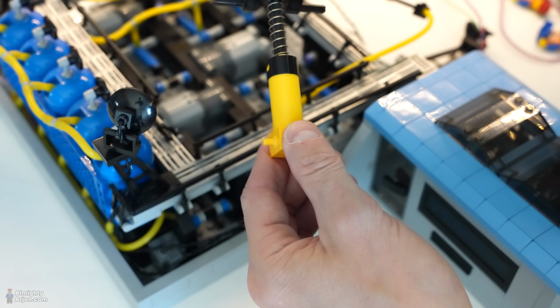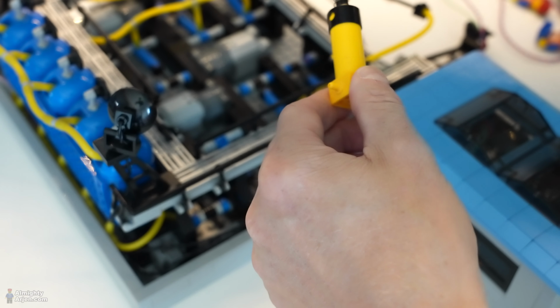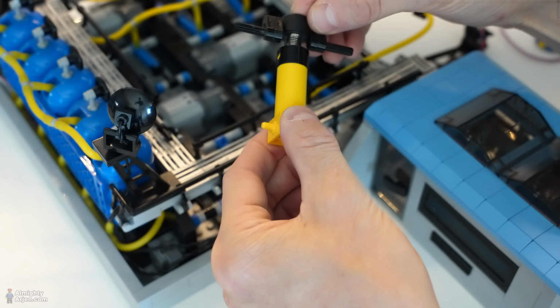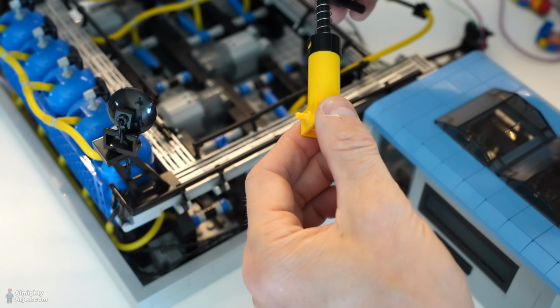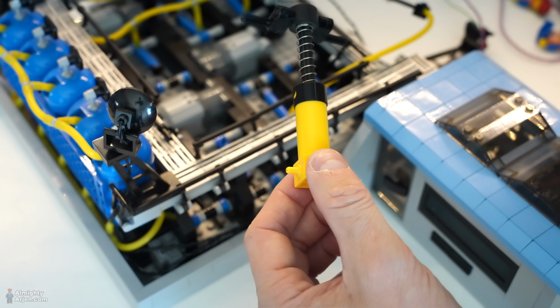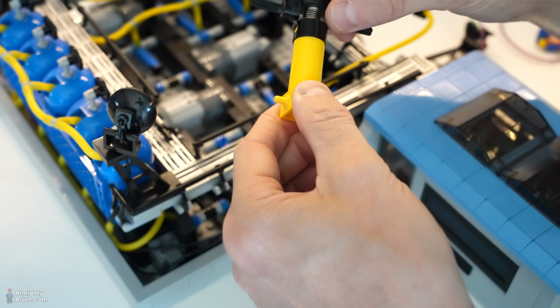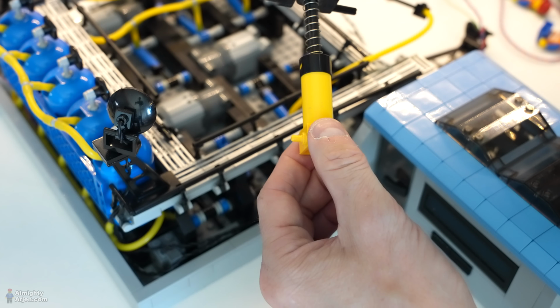And by doing so, when it's going down like that, there's a pulse of high current to the motor, and when it goes back up again, that current doesn't have to be that high. But the problem is that the coils inside the motor at that point are charged with the high current, and they're releasing it when it's going up again, something like that.